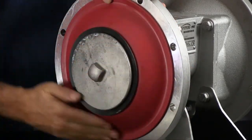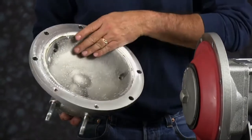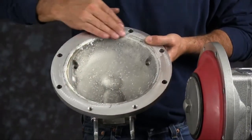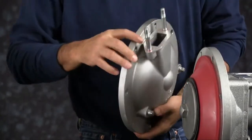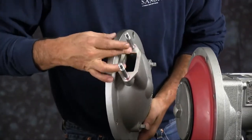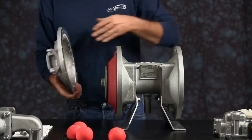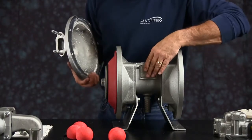Inspect the outer chamber for casting integrity. Inspect the machine faces and radius of the chamber for damage or material buildup. Scarring, scratches, or material buildup can be cleaned up by using emery paper, crocus cloth, or fine sandpaper. Port side of the chamber faces in the same direction as your nameplate.